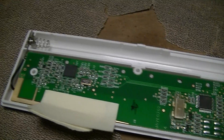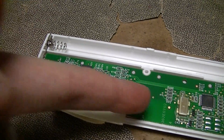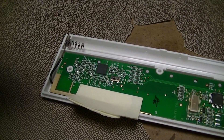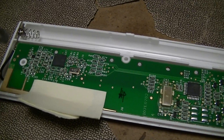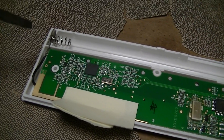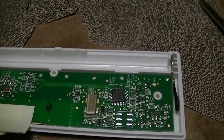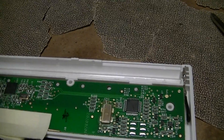On the other side of the board there are just a couple of metal dome type switches, where a metal dome mounted on the printed circuit board contacts a couple of contacts on the PCB — probably similar to a rubber membrane switch. There are a couple of surface-mount LEDs, and I think it was a 1206 or 1210 package cap right in that area.